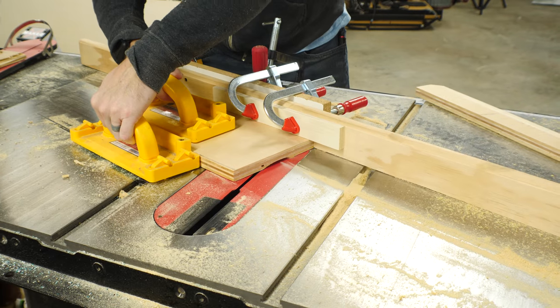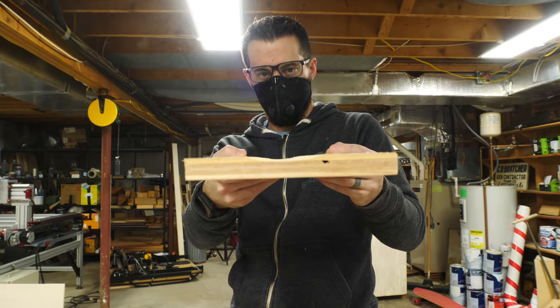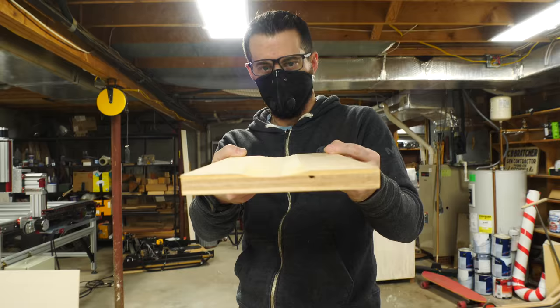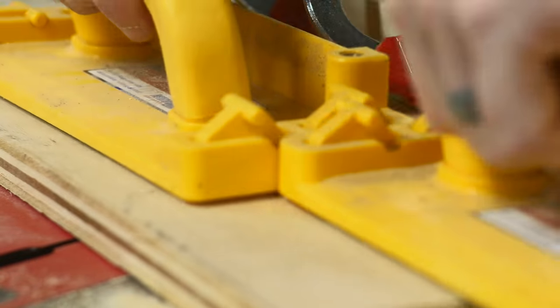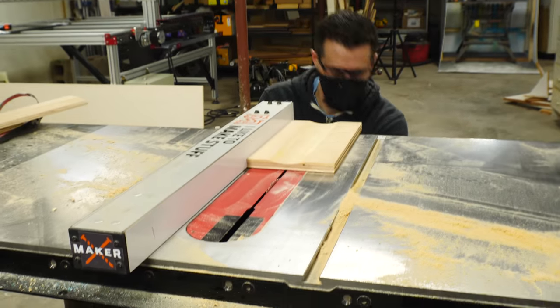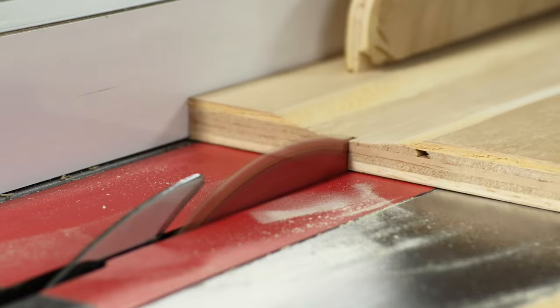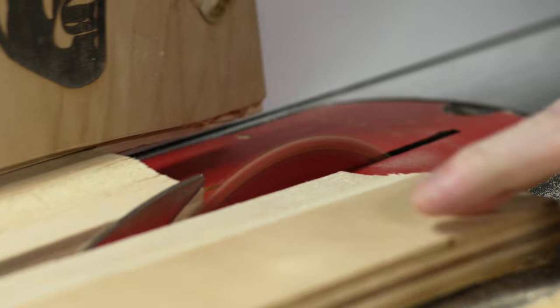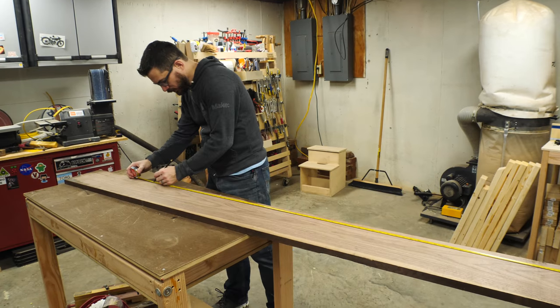This worked better, but I've learned since then that people actually make this piece captive between two fences — that holds it right where you want it. All you have to worry about is downward and forward pressure. I did a couple more passes to make the cove a little more pronounced, but before I cut it in half I had to make sure to put the riving knife back in. This is a little safety device that goes behind the blade and should always be there on a table saw. After I ripped it in half, I got to see what the coved frame would look like.